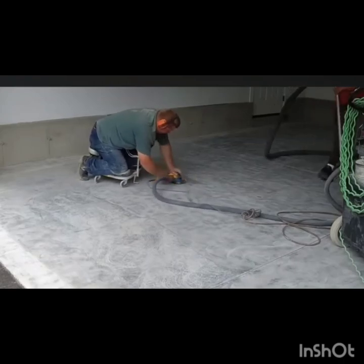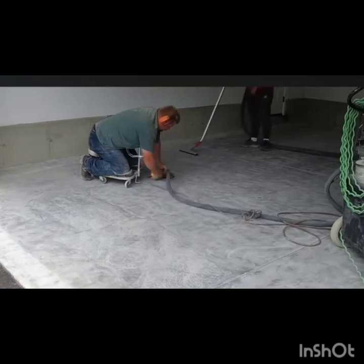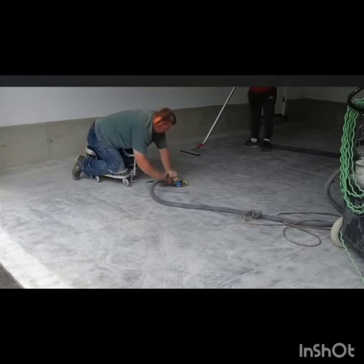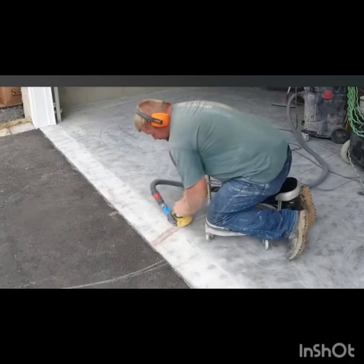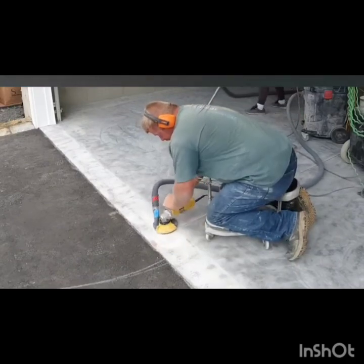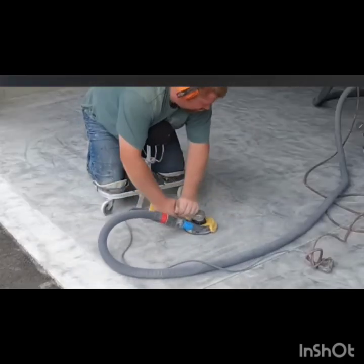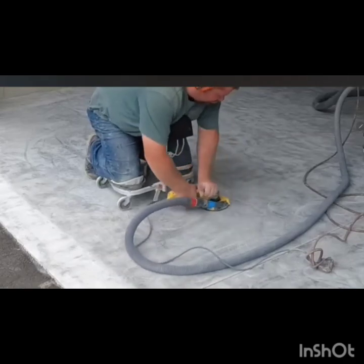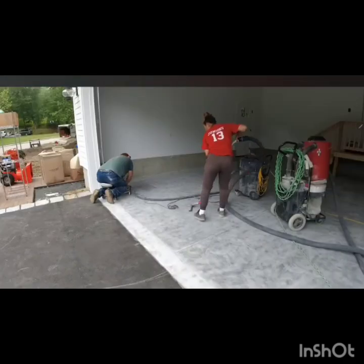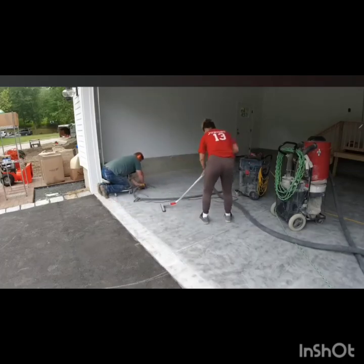Mixed with the epoxy, once the dust mixes in, it will stay there, and it's really hard to remove after you have applied it. Plus you have to walk on it. If you are doing epoxy, it's very hard to leave it like that. So after grinding it very hard and making it very smooth, all the places that are concreted, in this case they do not want their walls done, so we do not touch the walls right now, but we grind it a lot and try to get to the bare concrete.